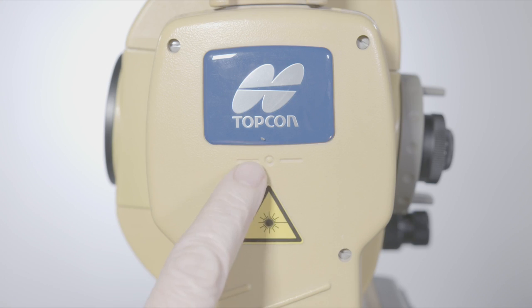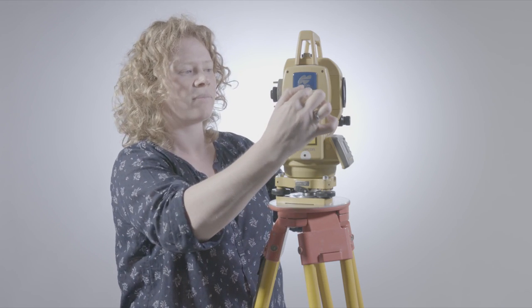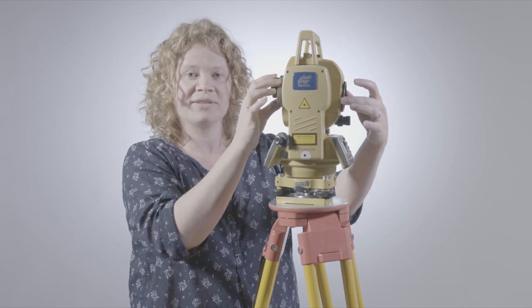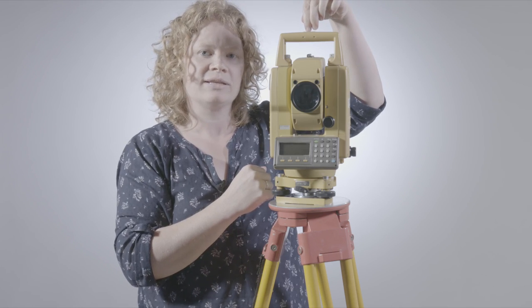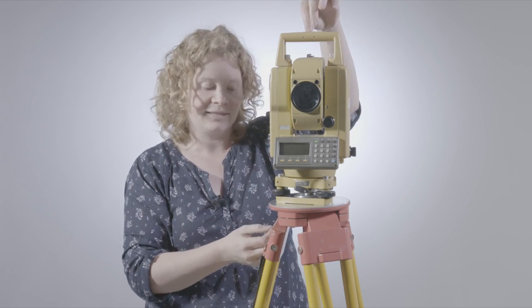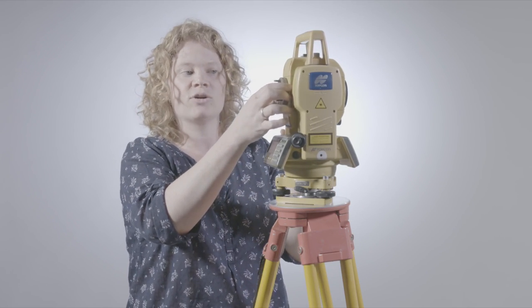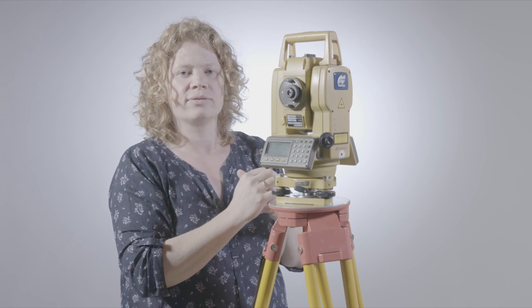If I turn this round, on the side here you'll see a little line with a dot in the centre of it — that is the centre of the horizontal axis. The horizontal axis goes directly through the total station; it's the point about which the vertical telescope pivots. Similarly, on the top, there's a small dent, and that is the true centre of the vertical axis, which is also in line with the point that we set up over. The trunnion axis is the axis of the telescope — if the telescope was twisted, that would be twisted about the trunnion axis.